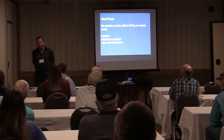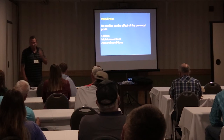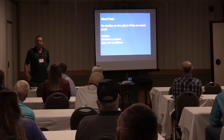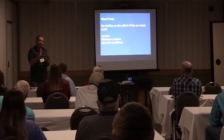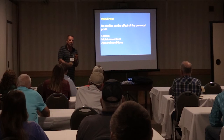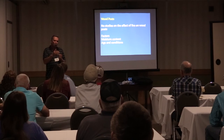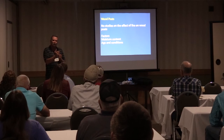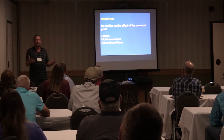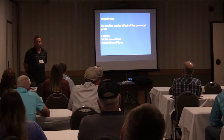They might lose a post every once in a while that finally rotted down. The other big factor is age and condition of the post. A lot of times you see corner posts catch on fire because they're old, they've got big gaps or rot, and there's some way that embers can get trapped in there. One colleague, Dave Engel — who worked on the barbed wire study with me — was working on a wildfire case in the Texas Panhandle and found a fence where the wire was fine but it was broke because it had wooden stays wired in between posts. Everywhere there was a wood stay, so much heat for so long burning on those larger wood stays did break the wire.